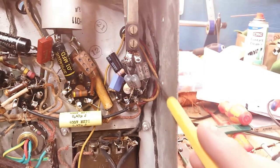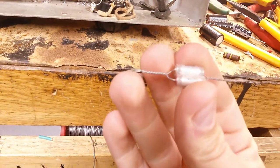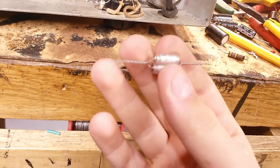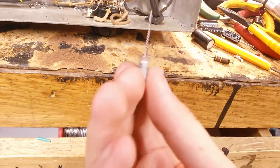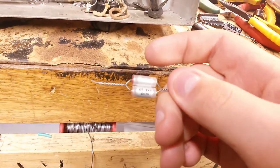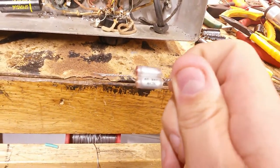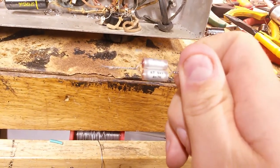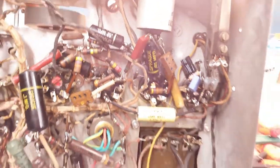This is the plate bypass, the one which is permanently attached. I'm using these capacitors to make up values — this here makes up 0.01 microfarads and this works fairly well. These are very good capacitors rated for a ridiculously high voltage. Each one of these is 0.005 mic and together they become 0.01, so these will replace a lot of the 0.01s in here.